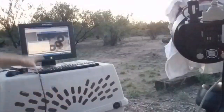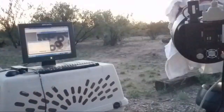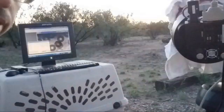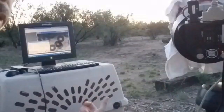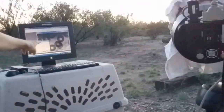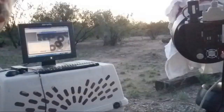And you can sort of see the flat field there. What the flat field does is it does 2 things at the same time. It's a measurement of gain on the camera itself. It's also looking at the entire internal optical path. So what you're seeing on the screen there, those round things, those are actually out of focus pieces of dust.